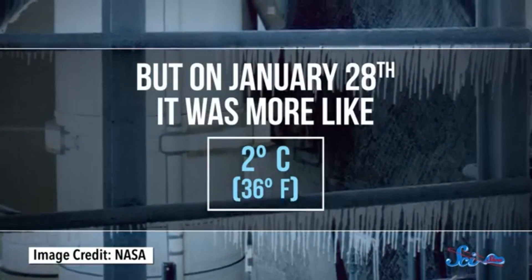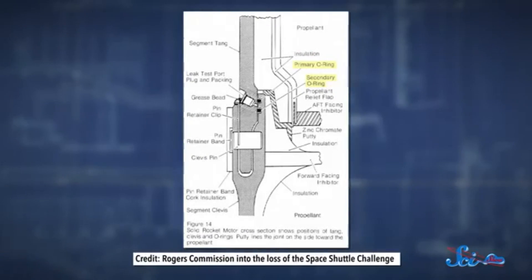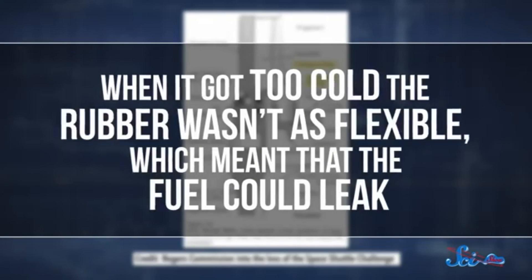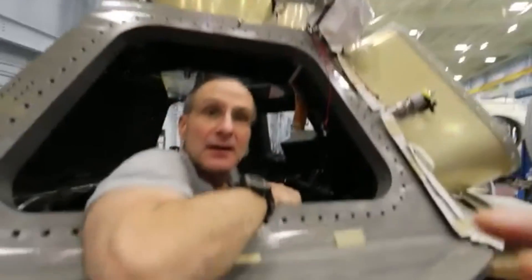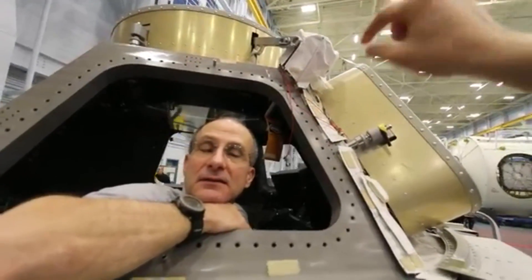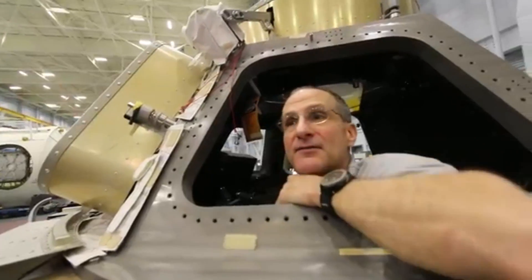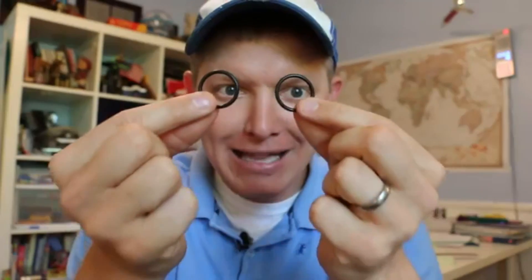On January 28th it was more like two degrees. Some of the engineers working on the shuttle knew that colder weather was a problem for the O-rings — the rubber seals that hold together the four sections of each solid rocket booster. When it got too cold the rubber wasn't as flexible, which meant the fuel could leak. How can you operate a lid on the outside of the space station by manipulating something mechanical on the inside without losing air pressure? It's called real good engineering. That means there's a shaft running through it actually rubbing on the O-ring, and the air you're breathing as an astronaut is being held back from the vacuum of space by two little bitty O-rings.